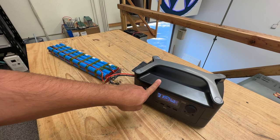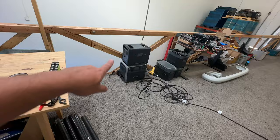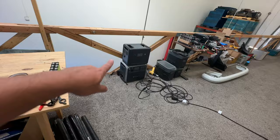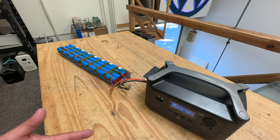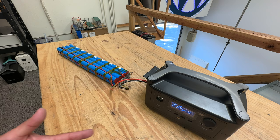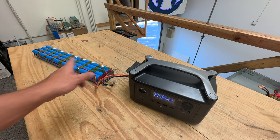This is a very easy way to extend the life of your EcoFlow River portable device, and it will work with anything that has around 25-volt input on the solar charge controller. The other bigger power stations have higher solar input, which is why we recommend using higher-voltage batteries with those. You could put these 24-volt packs in series to get 48 volts and connect them that way — those will work too. The scooter battery packs are already set up that way. We'll make more videos in the future on different devices and which batteries work, but this one definitely works with the EcoFlow.